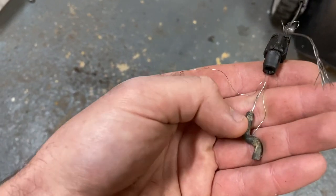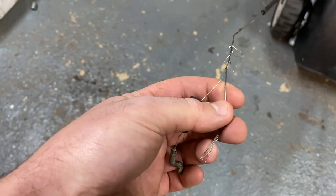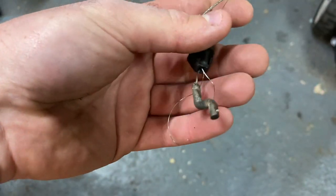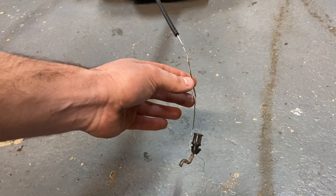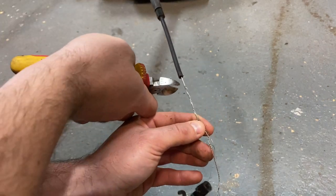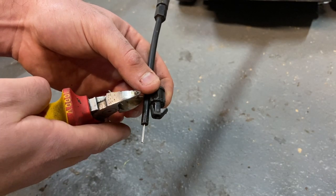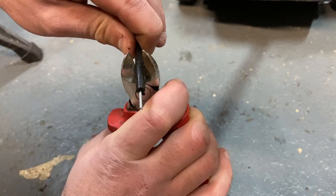As you can see it's only holding on by a few threads, and this cable has been stretched and all frayed — it needs to be renewed. So we're going to be remaking this end piece here out of some of that steel wire. The first thing I want to do is remove all this frayed wire, so I'm going to take it right back to where we've got some decent wire. I'm going to cut off this plastic sheathing all the way back to about here.